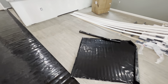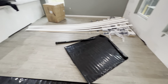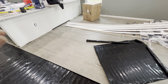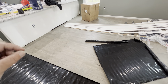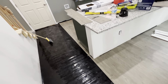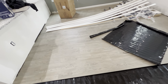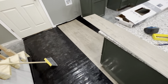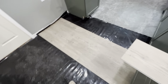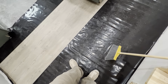So these vinyl planks — that's been my project this week, getting these vinyl planks put in. So far it's going really well. This stuff is actually pretty easy to work with. The main thing is to make sure that you don't have any little gaps, and any tiny sliver of a gap that comes up, you take care of it before you move to the next row. We also have to put this six mil plastic down because the concrete below will sweat. Another thing — make sure to keep everything clean underneath, because this stuff is pretty temperamental if you've got uneven floors or things underneath it. I've constantly had to sweep it and it just constantly gets dirty again.